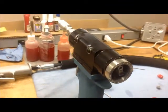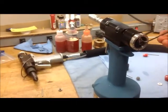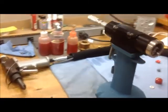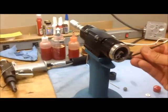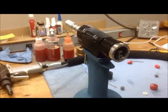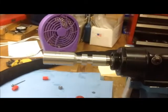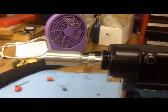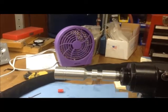You can tell by your gauge because it is actually the opposite. When you adjust this going higher, higher is actually going to be lower on the gauge — the gauge will recess inside those threads. When we turn it to the lower position — referring to the pin break height — if you want the pin break height lower, the gauge will protrude out just slightly. The piston is helping the nose to push the pin in further and break inside the rivet.